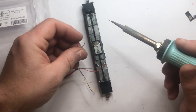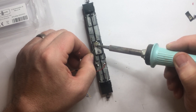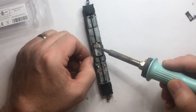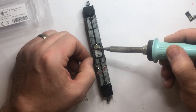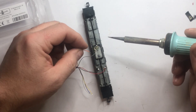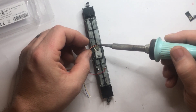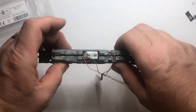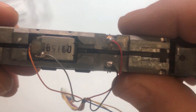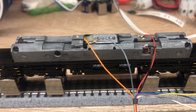So that's the track power on. I'll get the wire to the chassis, because the grey is what goes round the chassis and underneath. It's always a bit tricky because it's on the actual chassis of the motor, so it takes a little bit more heat to solder that on. Then the orange wire. I've actually put the motor in the wrong way around, which I didn't notice at the time - when you're videoing you typically do that. So I undid that and moved the motor around so it faced the right direction. There are the connections - we'll put the motor on test to make sure it's all working. Yeah it's on DC but it's running fine.